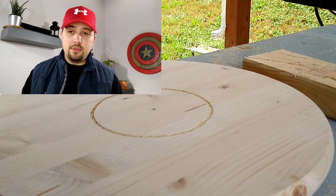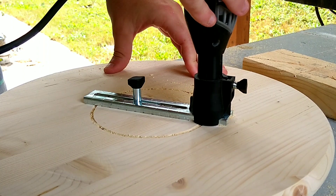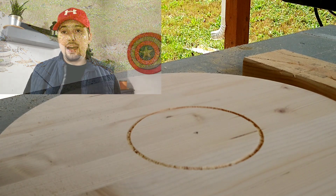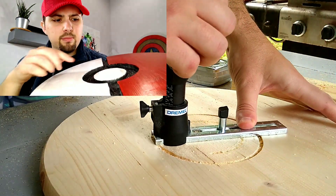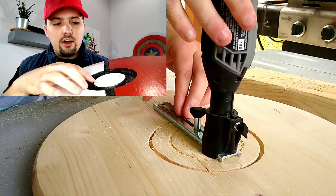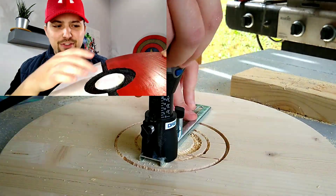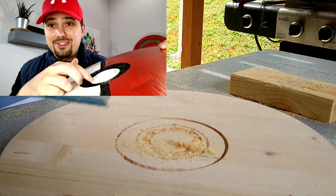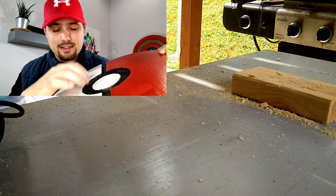After I located the center of the wood and drilled a hole there, I took my Dremel and adjusted its width or radius to various lengths to cut out these areas. I ended up hollowing out these areas by continually manually adjusting the Dremel width. Hopefully you can see on the camera — the middle button here is at the same level as the red and white surface. The material surrounding the middle button is actually raised up from the black surface. The black surface is all at the same level, and that's the lowest point of all the engraving I did.